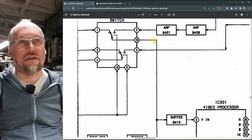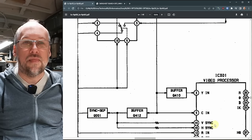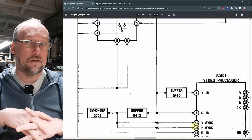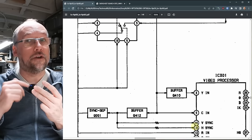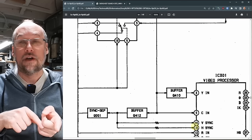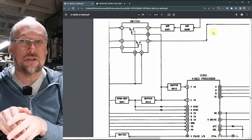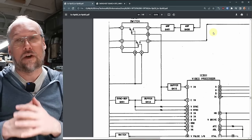There's one other detail: the video signal coming off the switch also makes its way through a buffer and into a sync separator, then into the horizontal and vertical sync inputs on the video processor IC. Whenever you're hooking up something to a television set, you need the sync information along with the video signal for it to display anything. On an RGB signal, you'll have the RGB lines and a separate sync line. We're going to take advantage of this set just taking regular composite video with composite sync and feeding that into the video processor to get the correct sync information for our RGB input.